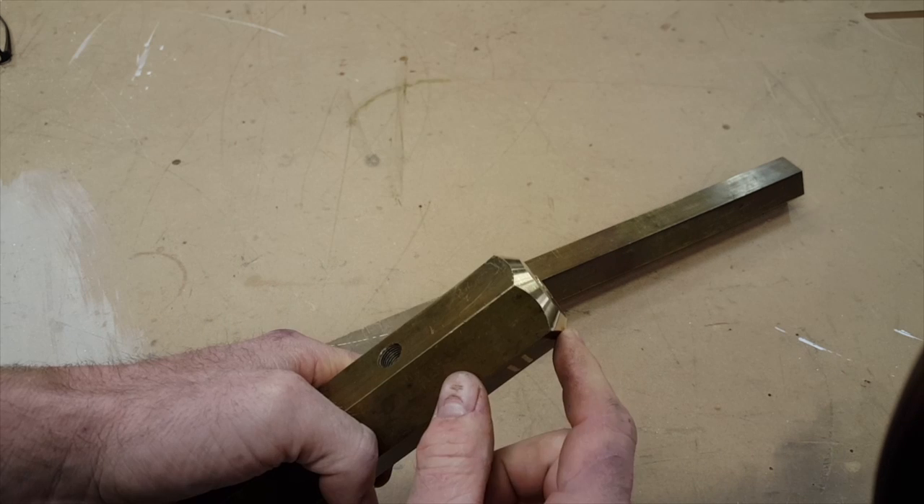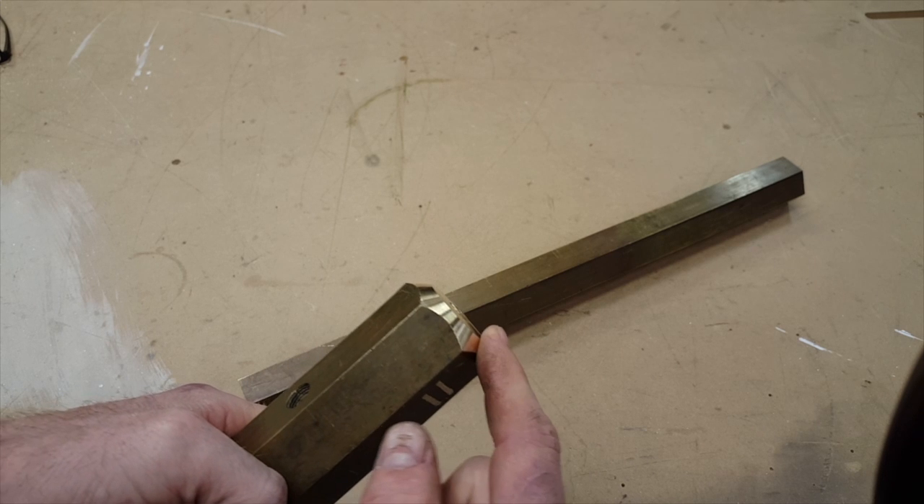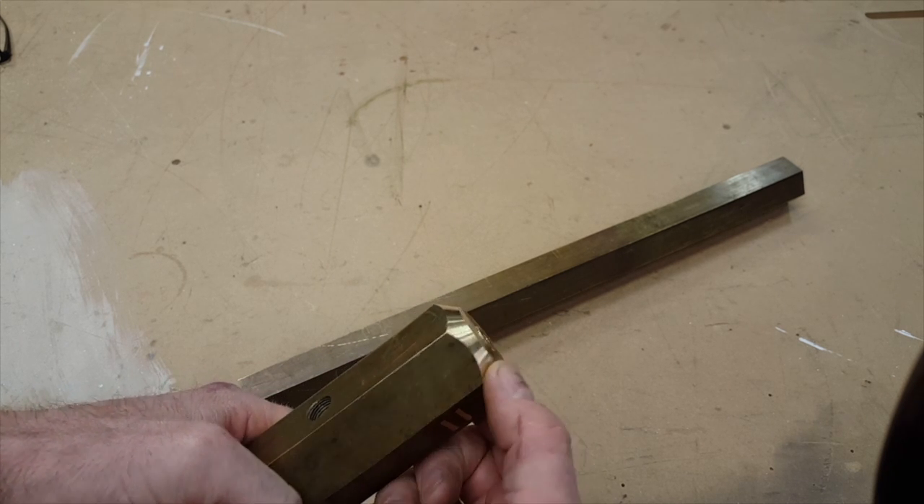I've been doing some tests and before I do that I need to sand the surface of this, because if I'm sanding that after I do this, I'm likely to come over the edge with the sandpaper and ruin that nice finish.